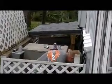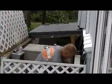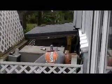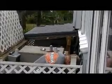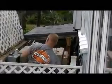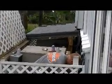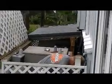In order to hook up the pump and inject well, we wanted to preserve the ability to connect the existing horizontal loop that operates the lower 3-ton unit and the superficial well that operates the upstairs unit. So we have a bunch of valving that allows us to run any one of those wells to the heat pumps as desired by the homeowner.